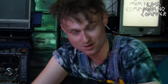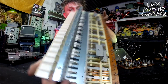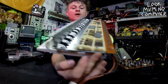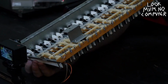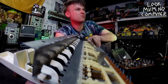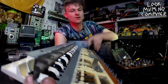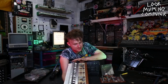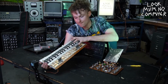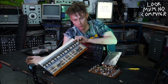The way it actually makes the contacts is this little bronze thing right there. There's a little silver shiny thing that pushes down onto a bare wire that's hidden inside this plastic assembly. And this same design is used throughout many keyboards, in organs, and all of those kind of things where there's just one bare wire running along. So if you've got a keyboard problem, like it's not quite making the connection, there might be some corrosion on either these bare metal spring things or on the bare wire that is going between all of the keyboard.